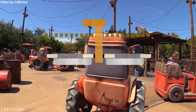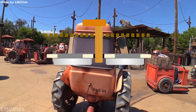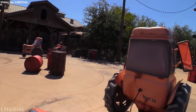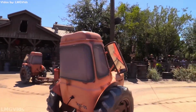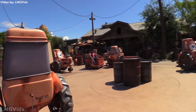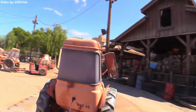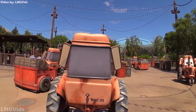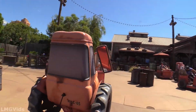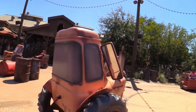The vehicles under the surface have two shuttle bars with two wheels each that hinge on the central column. Each shuttle bar has a vertical fin attached to the underside of the bars. As the ride begins, all platforms and spoke arms need to move together. The wheels on the shuttle bar will follow the underground channel around the turntable. At the handoff point, the channel straightens and the toggle wheel bumps the shuttle bar fins to the other turntable. This unlocks the shuttle bar clamp and slides the vehicle to the other side, where the receiving spoke arm clamps onto the other shuttle bar. So that's roll, unclamp, slide, clamp, roll, unclamp, slide, clamp, roll.